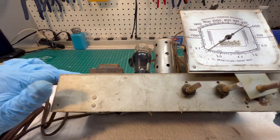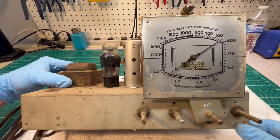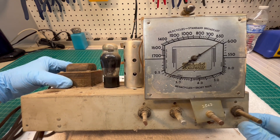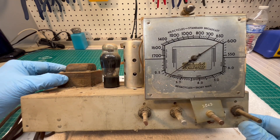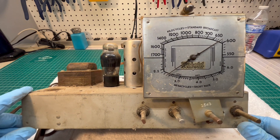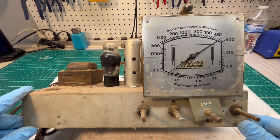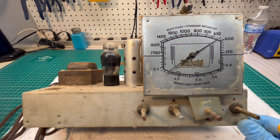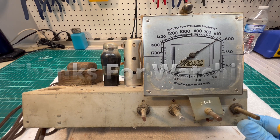More to come soon on this little Knight receiver — we'll say 1937, 1938, somewhere in that era. In the next video we'll start doing some testing just to evaluate the health of the power transformer, the IF transformers, the antenna coil, oscillator coil, and the loudspeaker output transformer — just to make sure there are no showstoppers or other things we'll have to figure out how to mitigate along the way. I appreciate you guys watching. Thank you.